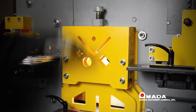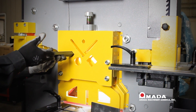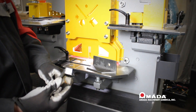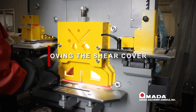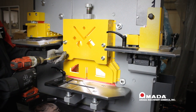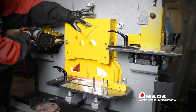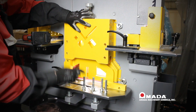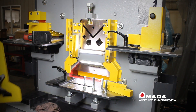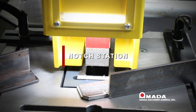The round and square bar shear is raised and lowered by the same adjustment knob as the flat bar shear and angle iron shear. When shearing round or square bar, the guard must come down and hit the material so it does not flex back on the operator. There is minimal deformation on the round and square bar material. To remove the cover on the shear station, simply remove the four allen head cap screws and the guard will come off, along with the two mounting blocks behind the shear cover. After removing the guard, you can place channel shear blades, T-bar, Z-bar, or other shapes — custom knives are available.